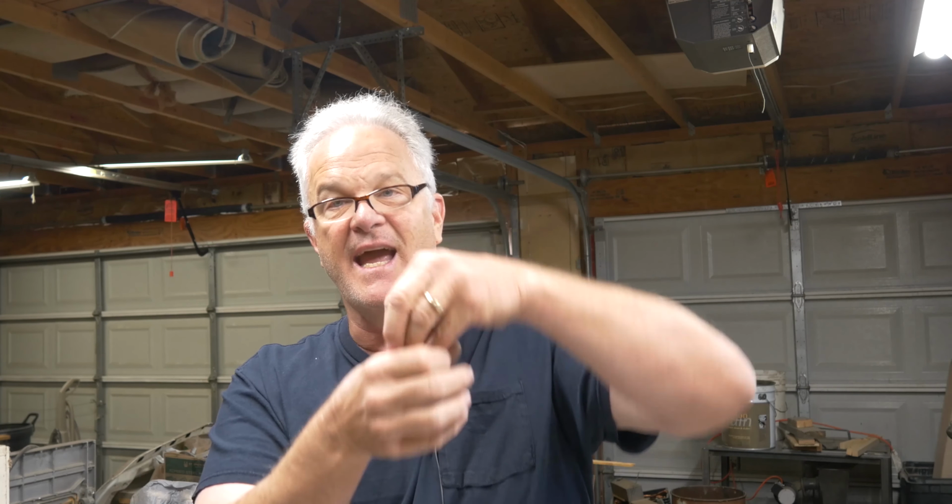And that's why you want to fill your sprue. You want to have a tapered sprue that naturally mimics the shape of falling water or falling metal, so that we can contain it wholly, and we can keep that sprue full and not have air coming in around the side. And that is the best demonstration I have ever seen on why we want a tapered sprue.